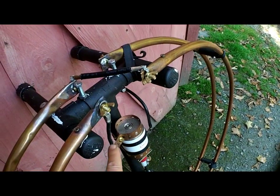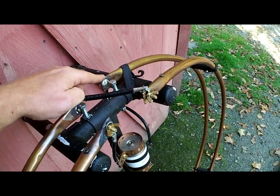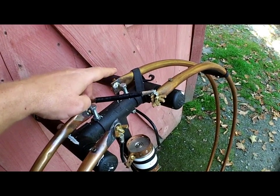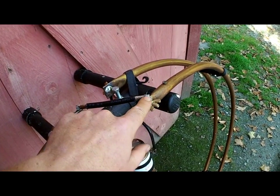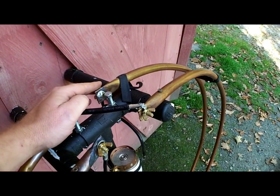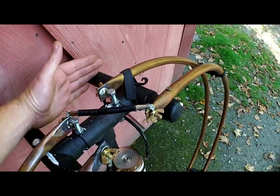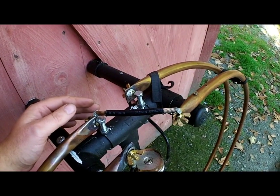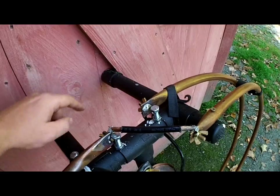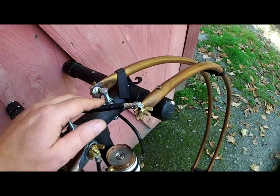The capacitor starts here and ends over here. It's still a coil-type setup but the loops maintain parallel all the time. I jump from here to here to continue the coil around and bring the capacitor in on the opposite side — the termination of the second coil. For 80 meters, another element goes on over here: I jump the termination of the second loop to the start of the third loop and move the capacitor to the termination of the third loop.